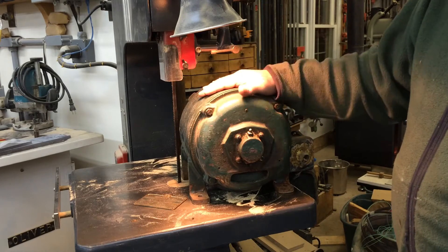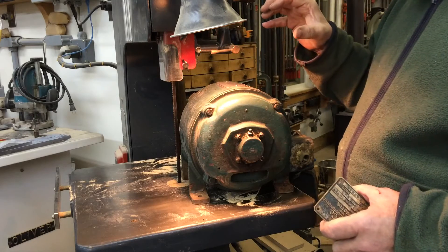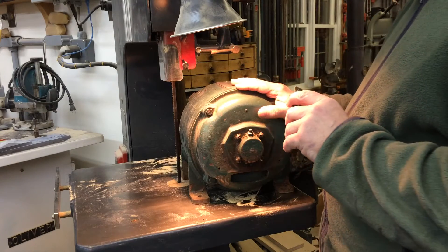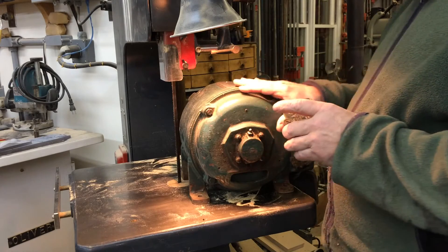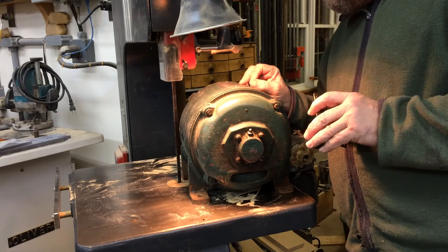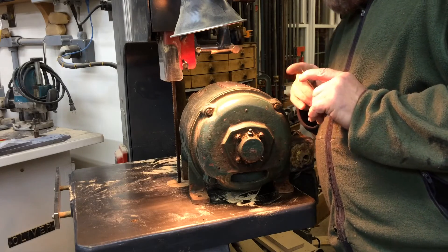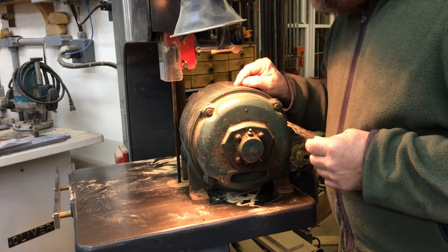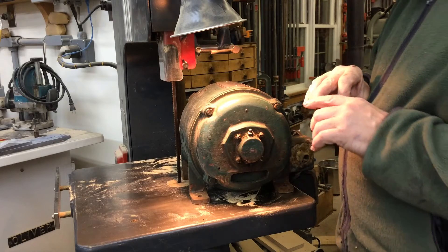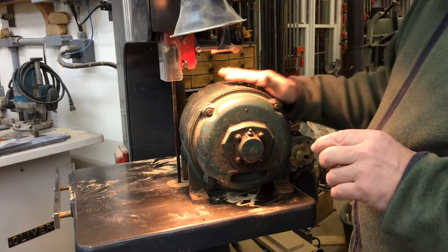Being that old, I am always surprised at how lovely these old motors were made. I think that in the very beginning when they made motors, they were very special devices, and a lot of care and engineering went into them. I've also read that the efficiency of earlier motors was actually extremely high. The service factor on this one is 1.15, which is extremely good. The horsepower is rated at three-quarters on the original tag, and on the conversion tag it says one horsepower. I imagine that's a mistake — perhaps they couldn't read it, as it is pretty small.